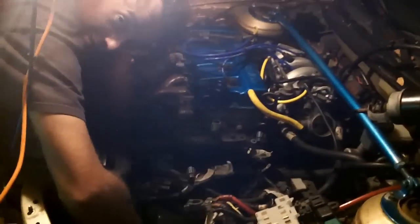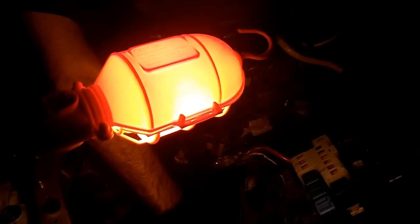The transmission cooler line clamp looks like it had been there for the life of the car, but it was actually recently replaced due to a transmission leak that almost killed the car. Mind-blowing fact for some: within the radiator there are two separate sections — one for coolant and one for automatic transmission fluid cooling. The transmission fluid runs through part of the radiator to be cooled, so there are two separate cooling circuits inside one unit.